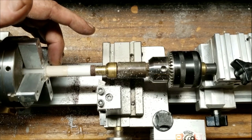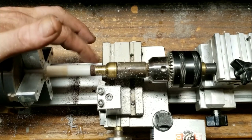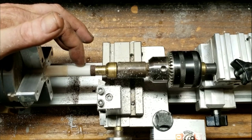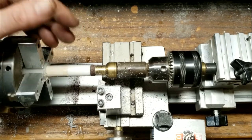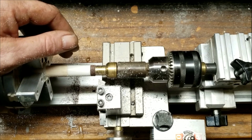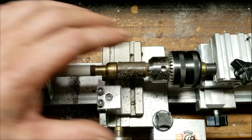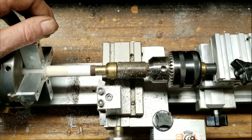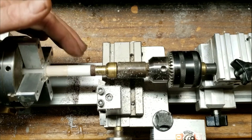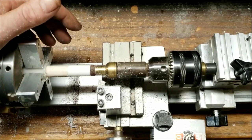When I build my shafts, I leave them full diameter. I put my tip and ferrule on, I cut it down to size, and then I come back, put it on the machine, and I will do a manual sand on the entire shaft to come down to the finished diameter of the ferrule instead of doing the opposite. You're going to get a much better finish that way.